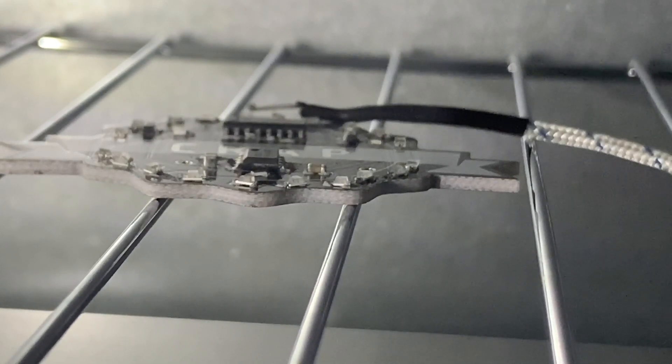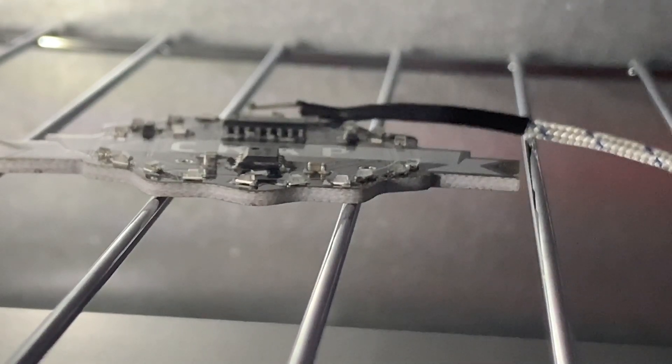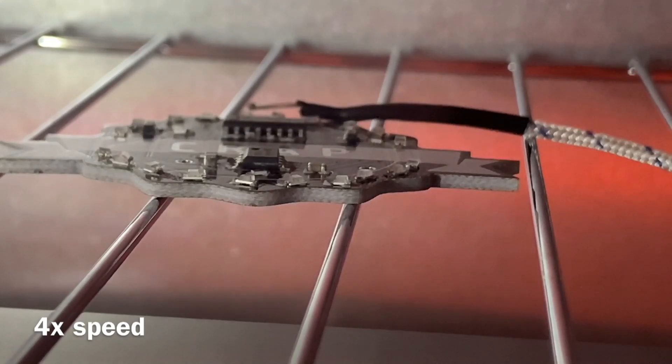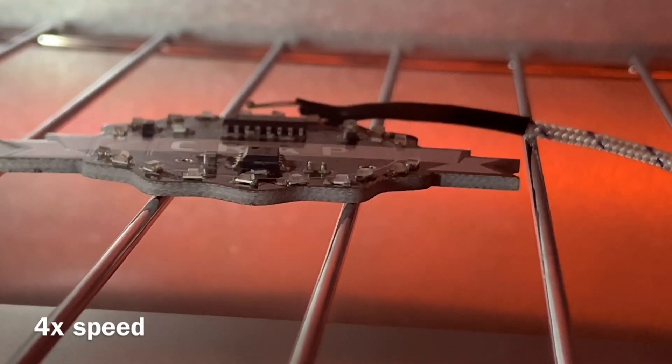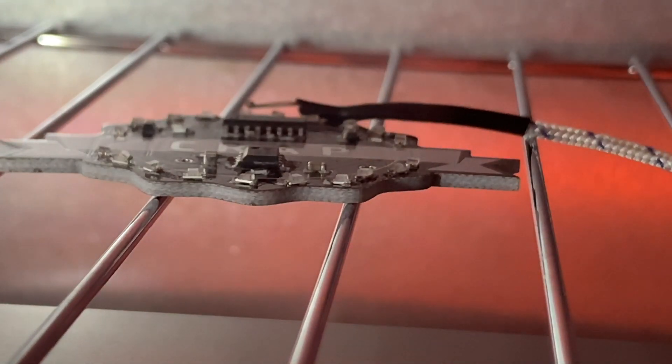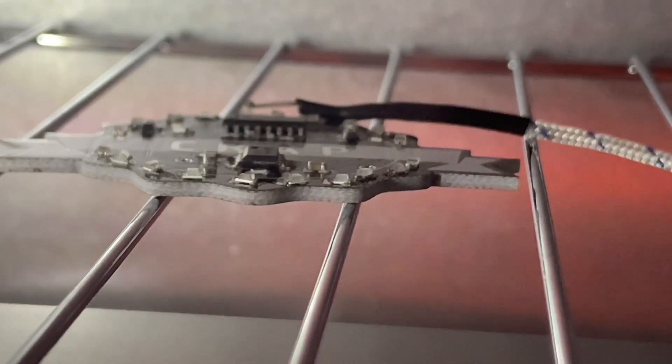You might not be able to see the elements coming on, but they're starting to glow orange now, so we'll just watch this process. At around 140 degrees, the pulses of the relay indicate we're in soak. It's a little slower now and we'll be moving up to about 180 degrees.